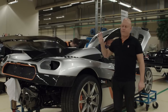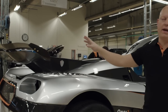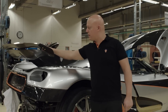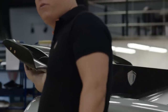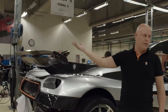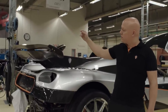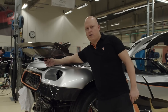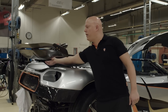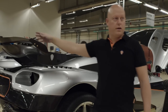This is the world's first top-mounted active rear wing ever made, as far as we are aware. The reason why it's top-mounted is because the most important part of the wing is the underside to create downforce — it's like an upside-down airplane wing. Traditional wings are mounted from underneath, which is the simplest solution, but that actually takes away an important area for downforce creation, more important than the top side.